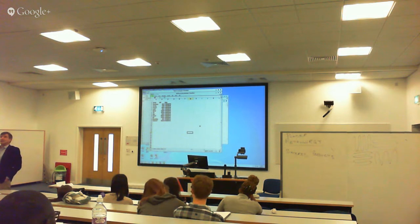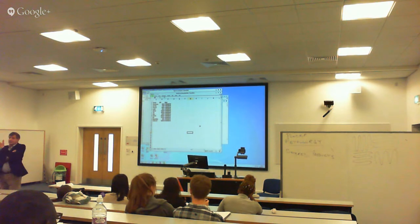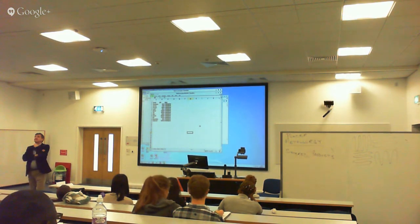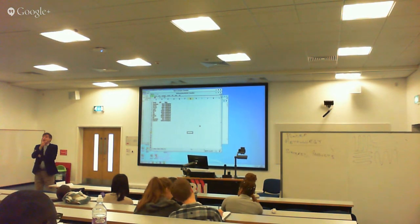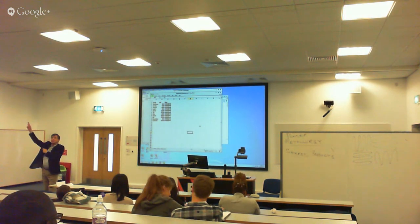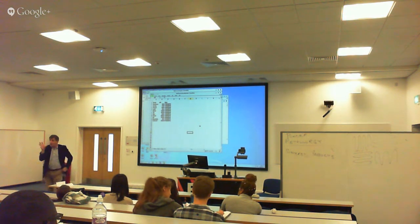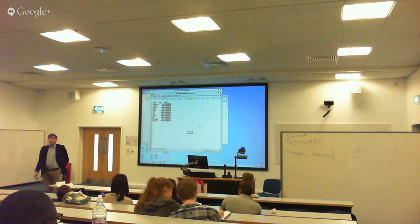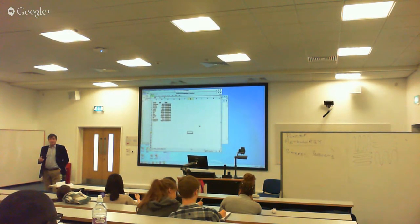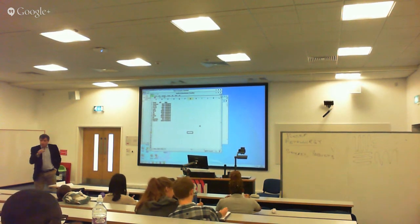Having said that, it's a very modern process as well, because now with CAD facilities you can produce the initial wax model. Once you have a solid model, you send it to one of these rapid prototyping machines that produces your wax model very quickly. So it's very old and very new. It's one of those very interesting processes, investment casting.